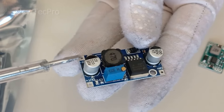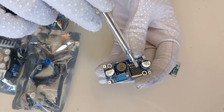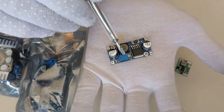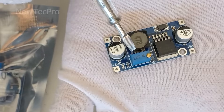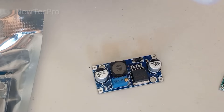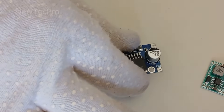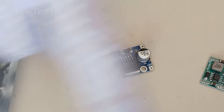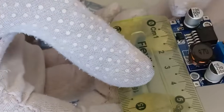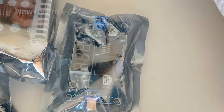Maximum output current is 3 amperes, but you should keep output under 2.5A and use a heatsink for long-time working. Using this potentiometer you can adjust the output voltage. You can see the tutorial video on how to use this module on our channel via the link provided.